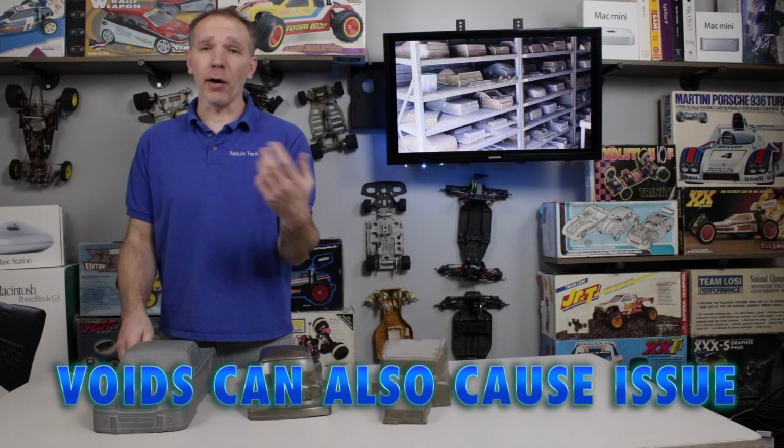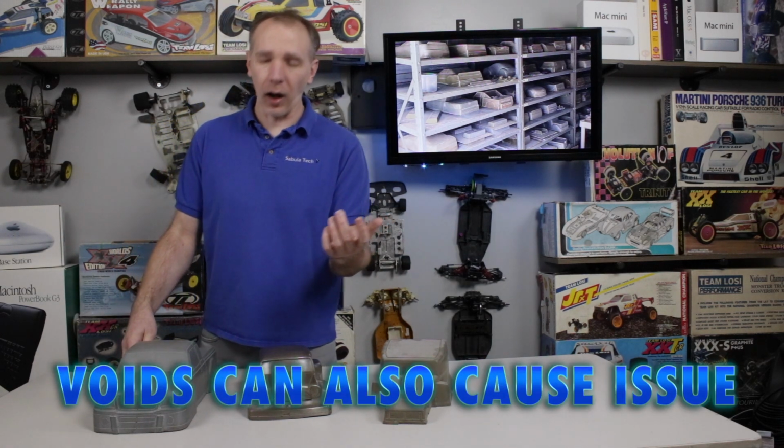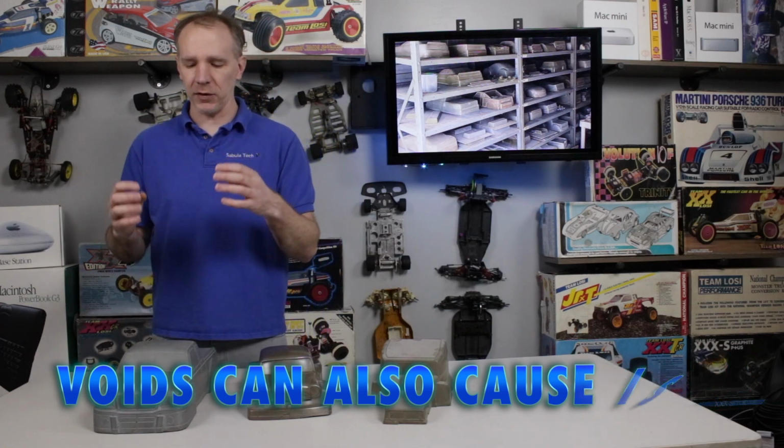We have one that was a reproduction that is pretty much out of commission now, because for Mr. Lexan, who we got the mold from, the person who created the mold didn't properly mix the two parts together, and there's a spot in it that expands quite a bit and bubbles up under heat. And now it's actually finally cracked and flaked off because of that difference in expansion. So when you're doing these, you have to make sure you get them mixed properly together.